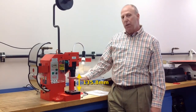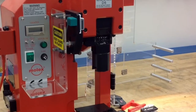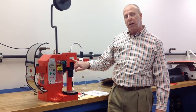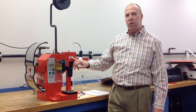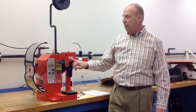What's very important to realize is that this height — 135.8 millimeters — is set at the factory with a shut height gauge. Once that setting is reached, the technician will read the letter and number established; for example, on this one it's D6, indicating this press has been calibrated to 135.8 millimeters. Please be advised that this number on the decal will vary from press to press and from Molex TM3000 to Molex TM3000.